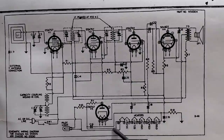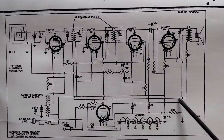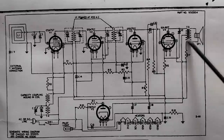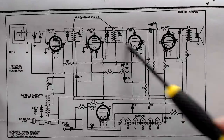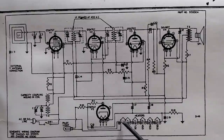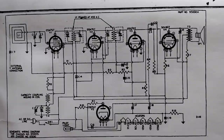Getting back to it, we've got the active on one side and the B-minus on the other — that's the across-the-line capacitor. It gets rectified, comes along and presents at the centre tap of the output transformer, which I think they're using as a choke to filter the power supply. It's a pretty simple circuit. The only thing I'm stuck on is sending everything through the one little filament. That seems odd but I'll accept that's what it does.